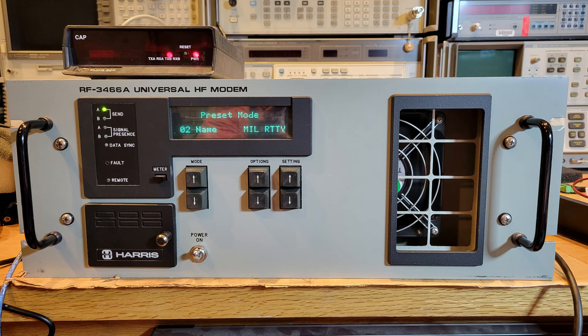The second problem I ran into was the signaling rate. RTTY in the U.S. operates at 45.45 baud, also known as 60 words per minute. Computers and laptops these days are no longer made with serial ports, so we are forced to rely on serial-to-USB adapters. The problem is these rarely — maybe never — support such a low data rate as 45 baud. The one I have, which is considered a decent one, only goes down to 110 baud, so that clearly wouldn't work either. I was really struggling to figure out how to solve these problems, and then I remembered a little device I had bought off eBay at least 10 years ago — finding it was no easy task, but I found it.